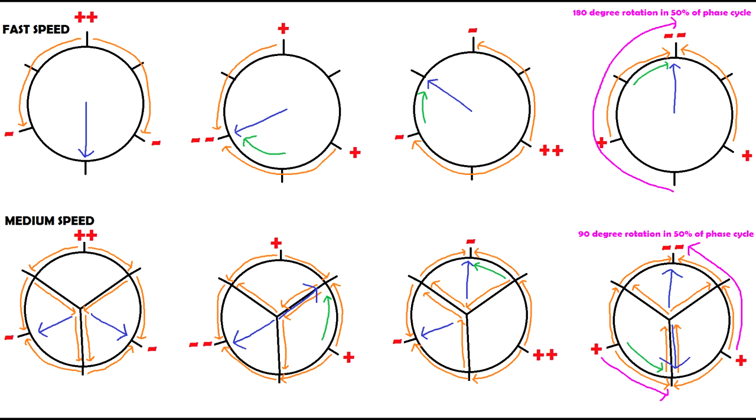Now, for the final thing to talk about, this six-phase pole changer motor with three speeds. How does leveling speed work? Considering at medium speeds, 1 meter a second, full speeds, 2 meters a second, and leveling speed is 0.3 meters a second. So let's just think about what it sounds like at leveling speed. So imagine you've got a three-speed pole changer lift. This is what noise it'll make.